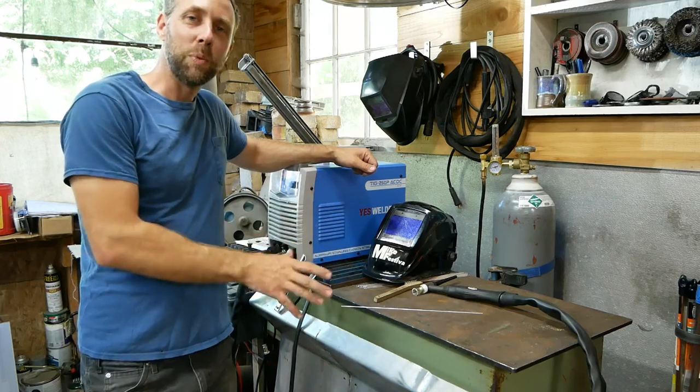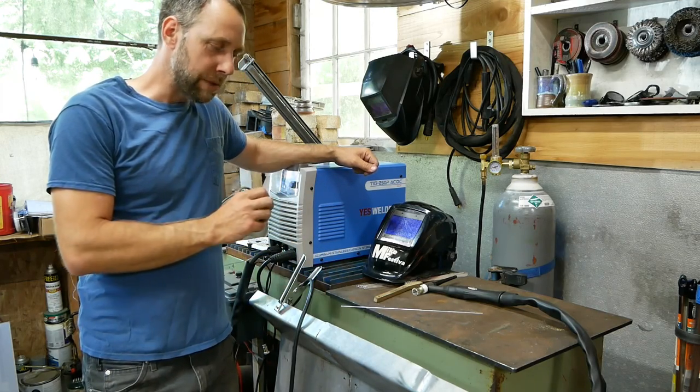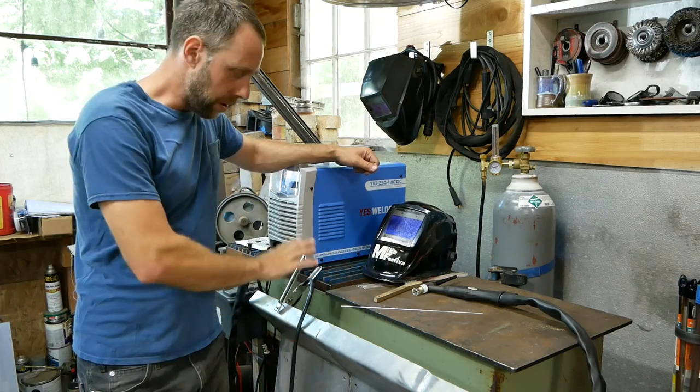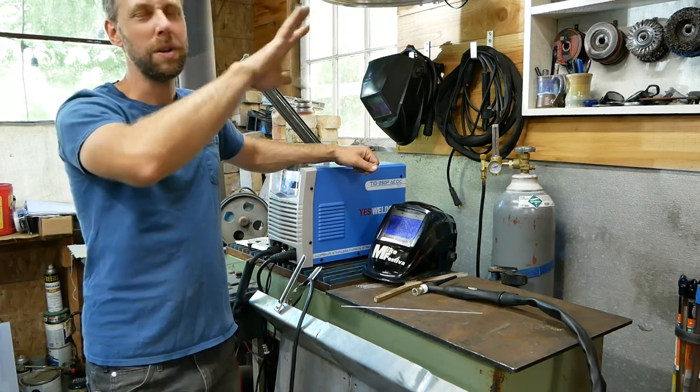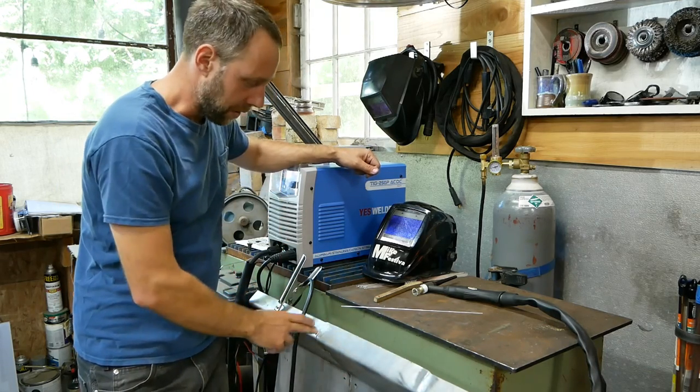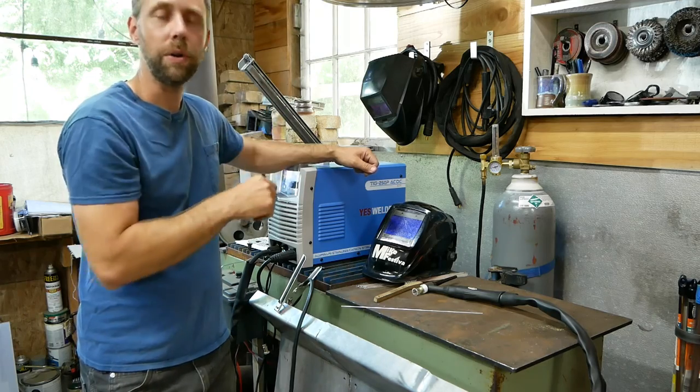All right you guys, got the roof off the tractor, and because it's salvaged aluminum, it's got some drill holes in it. I'm just going to fill in the little holes. I don't really care cosmetically how the spool gun welds look on the roof, as long as it's sealed off, that's fine. But these gutters, I'm going to go back through where you can visually see them and TIG weld all those.